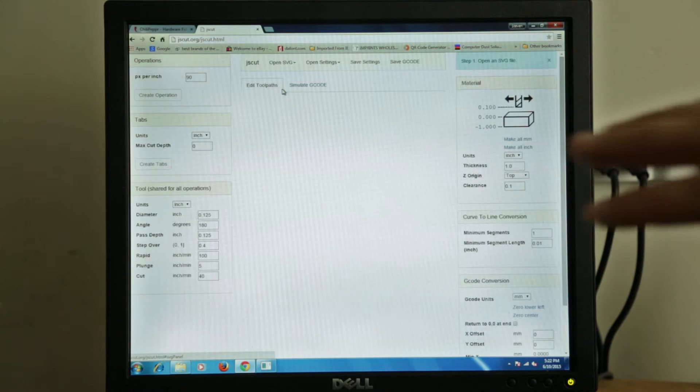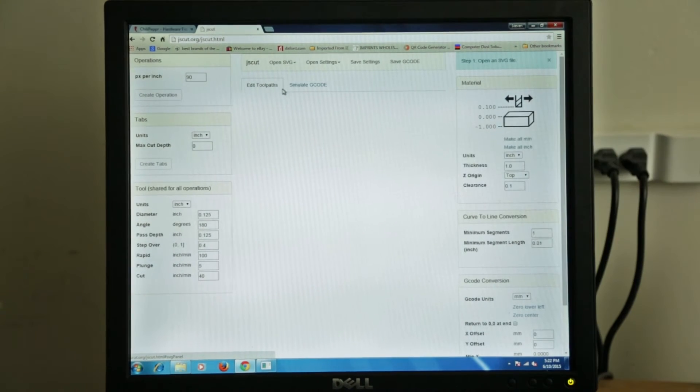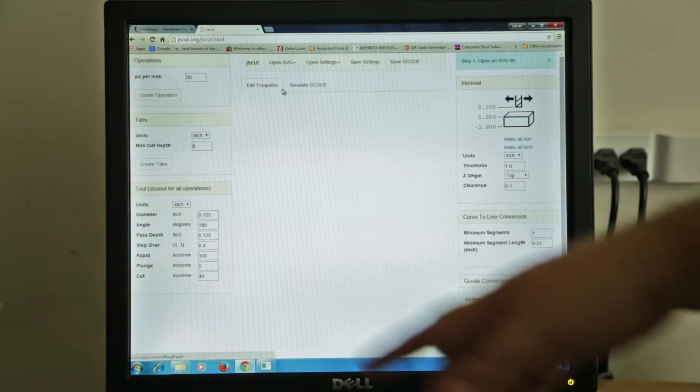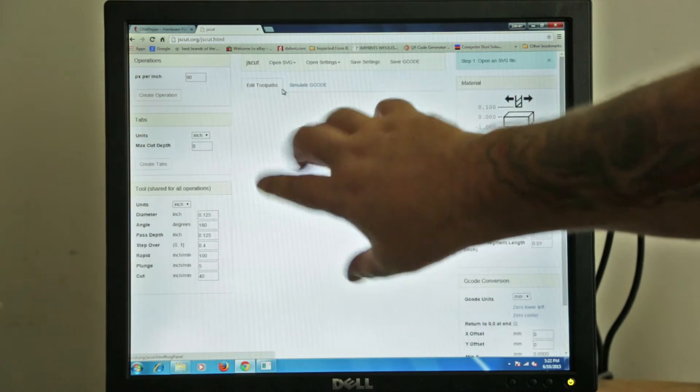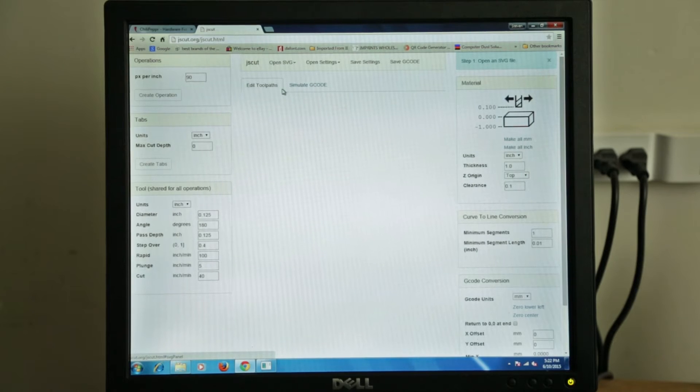You can bring in different parts. So if you're cutting on quarter-inch 6061 and you're using the same tool, it's all there. There's no reason to make a change other than the actual part itself — your tool path — that would be the only change. So it could be really quick to change parts out once you've got your tool and your material stuff lined out.